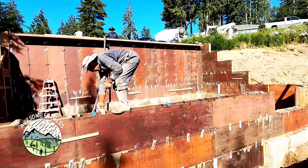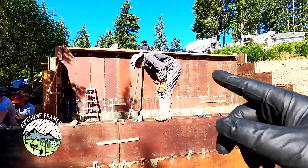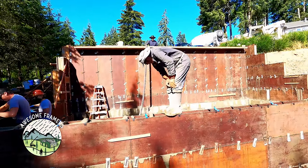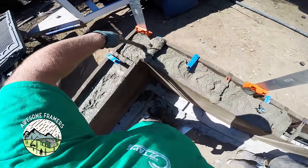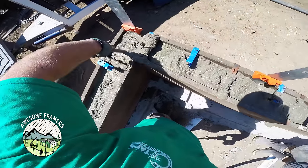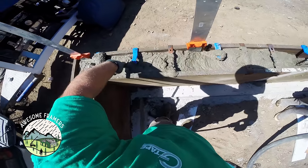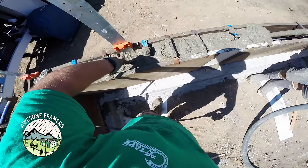Paul is not just a pump guy but an educator, and that makes all the difference. This Makita cordless concrete vibrator works really well. It's especially important to vibrate that concrete around hardware like those hold-down straps. The tighter your mix is, or the more rebar you have in a tight space, the more important it is to use a vibrator.